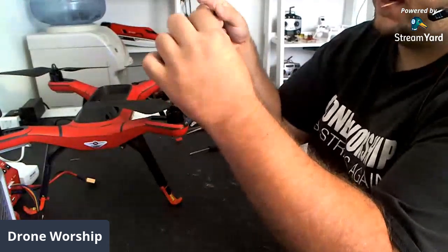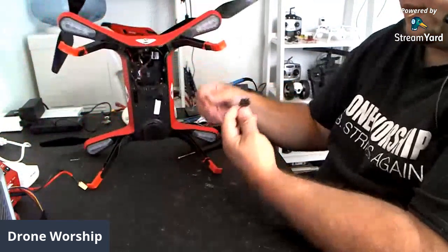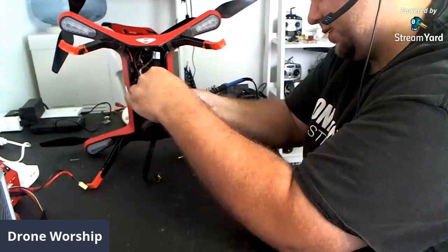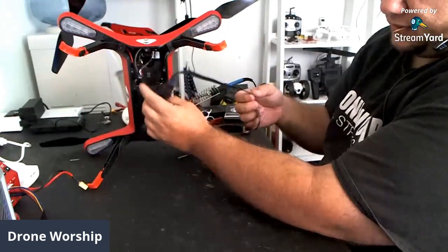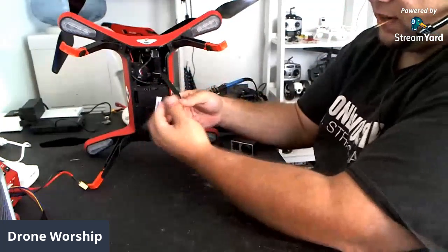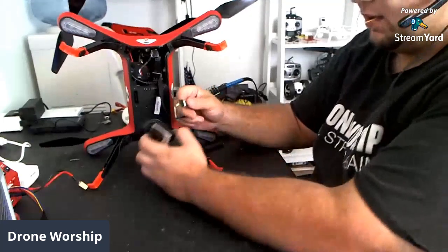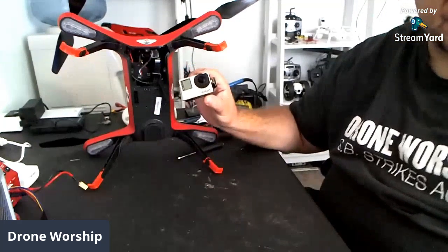You'll also need to order one of these wires — this is a third-party connection for the HDMI port on the bottom of the Solo. This will actually plug in just like this, and now you can extend the wire because this doesn't hang down far enough and it's not loose enough to connect to the gimbal. This will allow you to tuck all this back up in there once the gimbal is installed and you'll have a nice loose wire to plug into your GoPro system. I'll put the purchase link for this in the description. This plugs directly into the HDMI port on the side of the GoPro — just like that — and then you have FPV.